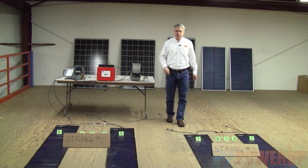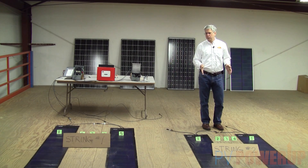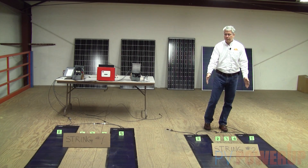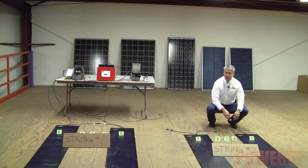The key to your solar system is of course the solar panels, and they are designed to be connected together in strings. What we have here is showing you roughly a string of five. The way this works, each module comes with a positive and negative connection — just like batteries in a flashlight — where you go positive to negative, positive to negative, all the way down, so that you get a string that gives you a certain voltage.